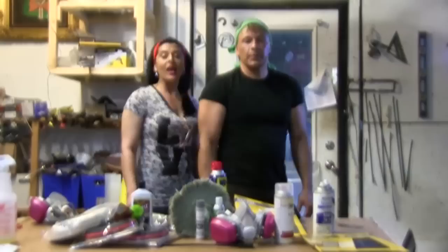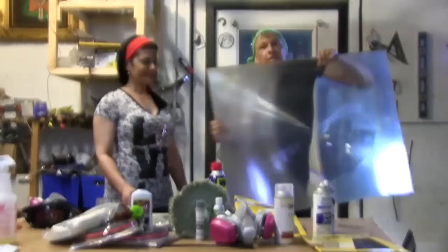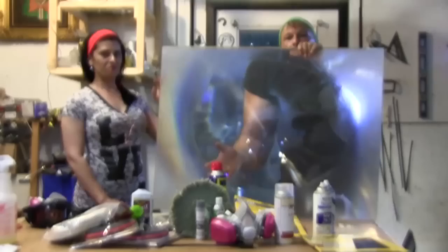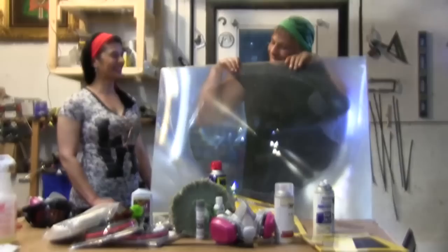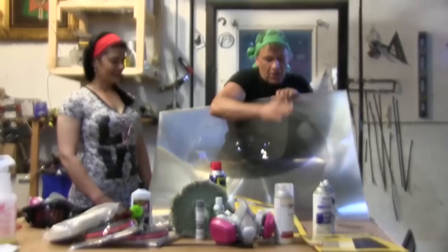In this video we're going to be showing you different ways of converting a linear lens to a spot lens. The first way is to put a resin on the front. This is a linear lens — you can see it in the outer portion here, and this area is nice and clear. This lens has resin put on the front that fills the grooves. The resin sticks to the grooves, fills it in, and then by having a nice flat surface you end up with a spot lens.